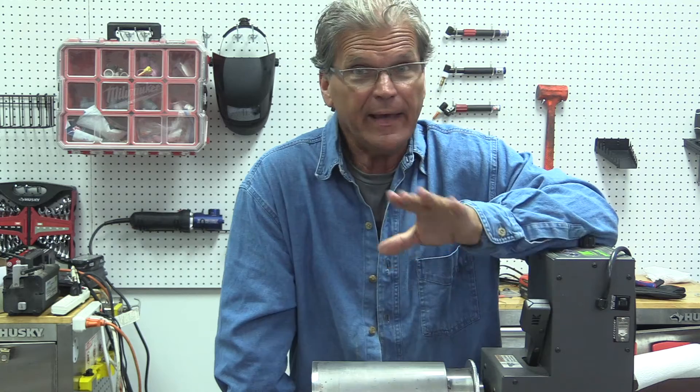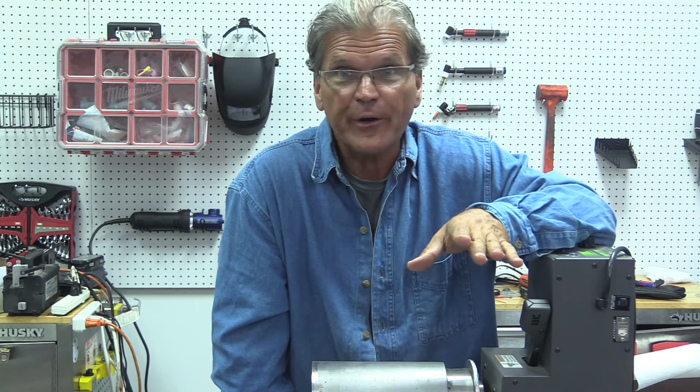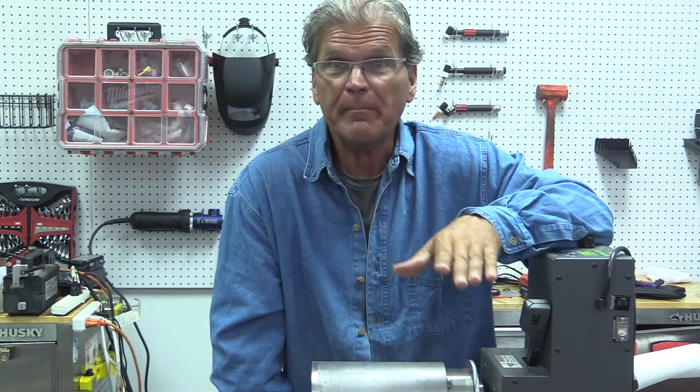I started to make a new video today and I'm really rusty on TIG welding, so what do you do? Just run a bead — to shake the rust off, I'm going to run a bead on the edge of 11 gauge cold rolled. We'll talk a little bit about high speed pulse because I really like high speed pulse on an edge or near an edge.